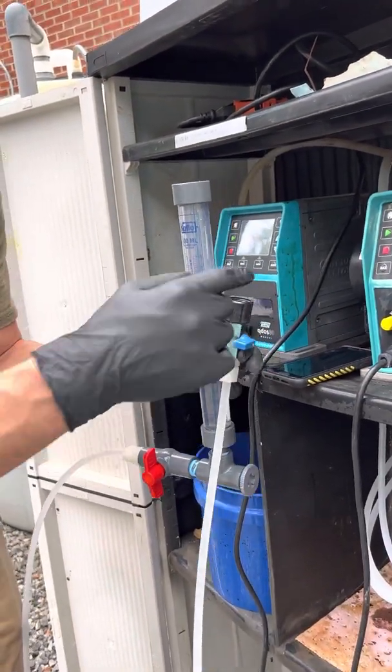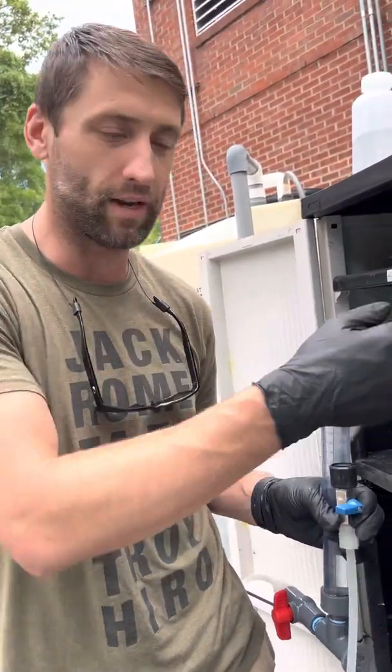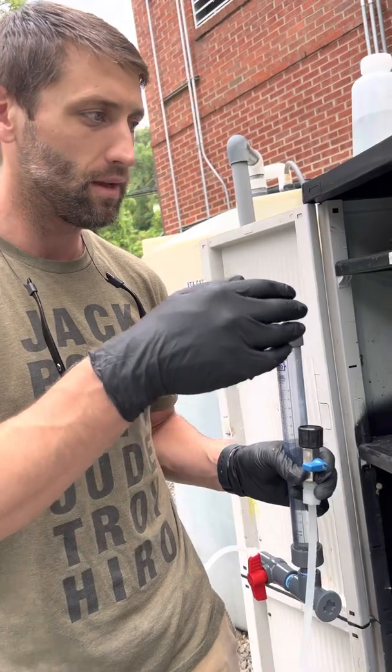If I did, then I confirm that the pump did 52 mils — which is one fourth of the 208.9 mils per minute rate — and I can confirm that the calibration is correct.